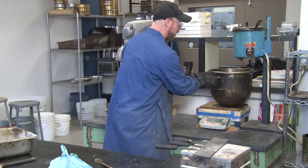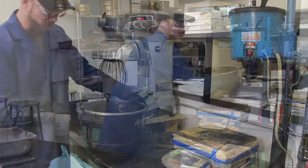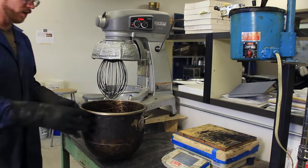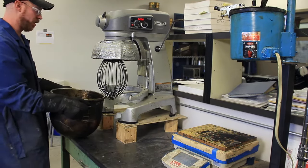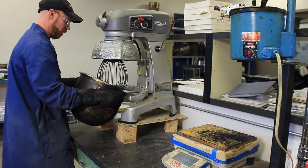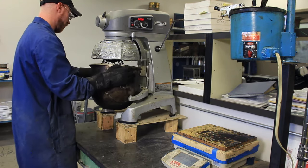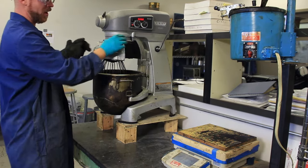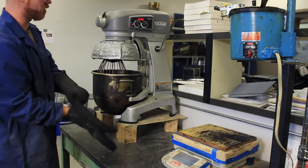We're going to put our mixing bowl onto the mixer. You want to have the one with the two on the left side when you're looking at the mixer, and the other one on the right. To get it on the mixer, you have to slightly tilt your bowl forward and then up around the whisk so you don't get it caught on there. Put it in place — there's a little magnet here — and you want it below this little rod, otherwise your mixer won't start.